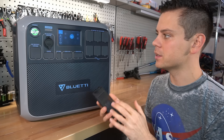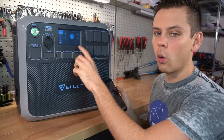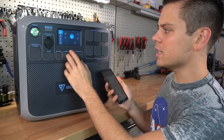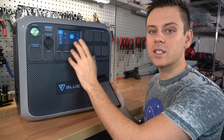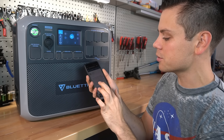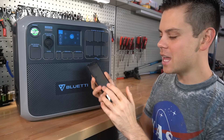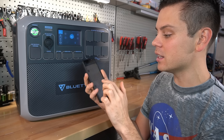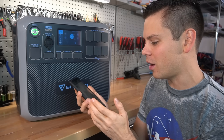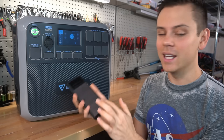The first major complaint on the forum is that many people do not have the shunt calibrated correctly — it's either showing zero watts going in and out of the battery or is horribly inaccurate. One person complained that the standby consumption of the AC inverter was showing 135 watts; on mine it shows zero. Another person had the same problem at 120 watts standby, with the inverter appearing to use twice as much as it should under load. A third user in the UK reported the same issue with a power factor correction deviation. The suggested fix was connecting a load above 200 watts to reset and recalibrate the shunt, but the original poster tried that on customer service's advice and it did not fix his problem.